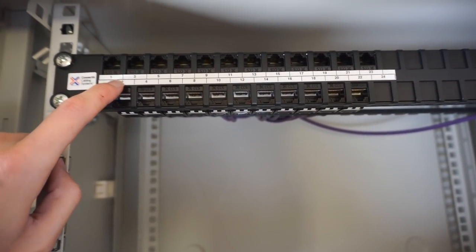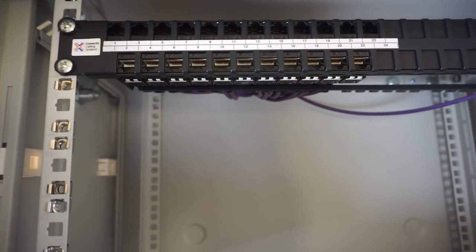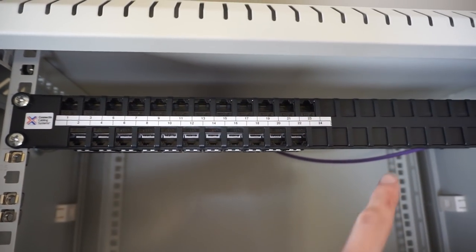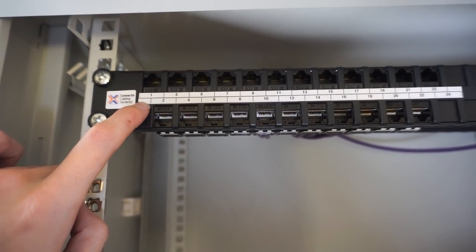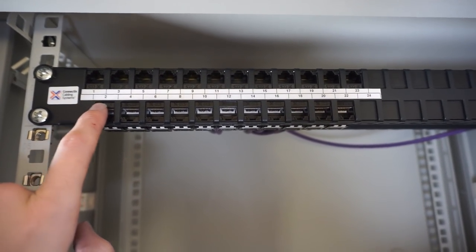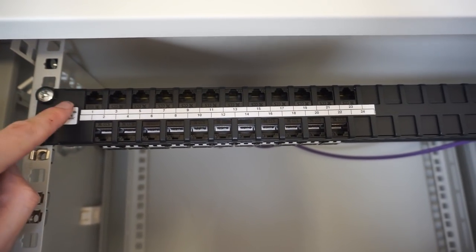It was like 4mm high and something wide, like a tiny little thing. And then all that does is generate a table in Word of the correct dimensions. So I did that, put the appropriate grid lines in, put the number in. To do the offset second row, I just copied that to the next line and adjusted the spacing at the front, the margins, just to move it along a little bit. Set the grid lines and then set a very faint grey grid line around the outside so I knew where to cut. Print it on a big A4 label.